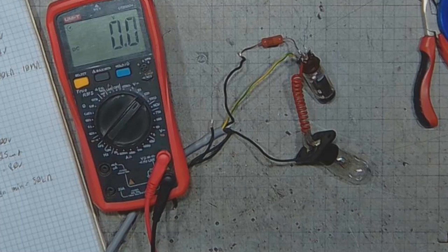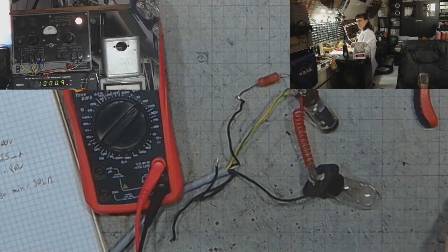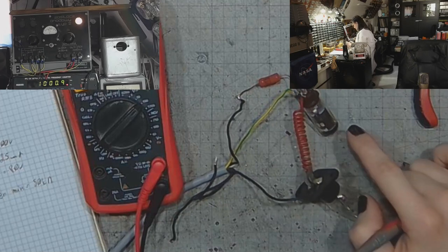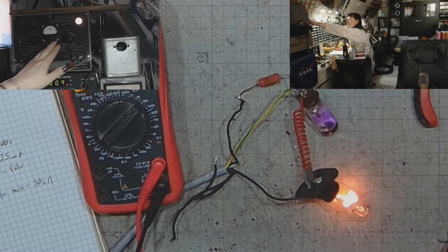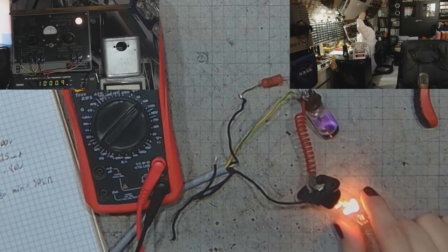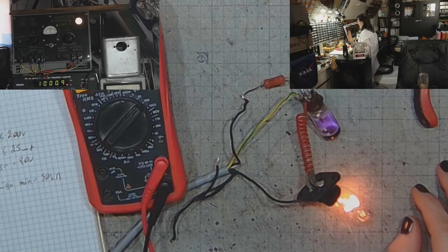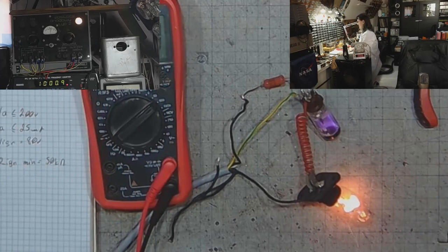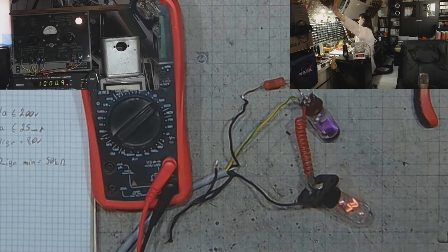Wait until this thing comes on again. The plate voltage is rising. And let's raise the plate voltage. It ignited. So I must have passed the self-ignition threshold. That's something like you see with voltage regulator tubes. Like you've got two electrodes, the anode and the cathode, and after reaching some threshold voltage, it will ignite and keep a steady voltage way lower than the ignition voltage.